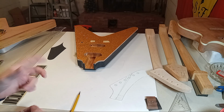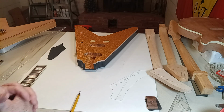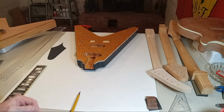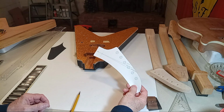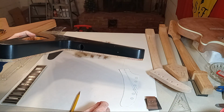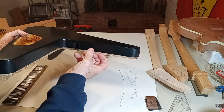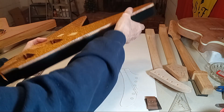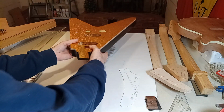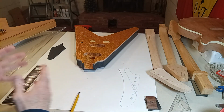And I'm getting pretty good at really understanding how it went together, how it was designed, what Gibson was thinking of, and what's the difference between this guitar or an authentic late 50s Flying V versus the Explorer that I'm about to build. Just the shape of the body and the headstock. That's about the only difference, because from what I've gathered in my research, the body thickness, this is 1 and 11/16. I believe that the Korina body for the Explorer and even the V was about a 16th of an inch thinner than this. I love this profile. It's a beautiful thickness, but nonetheless, I would not dare go any thicker than that because this Korina body is not something that I want to start chambering, and it's a large block of wood, which equates to weight.